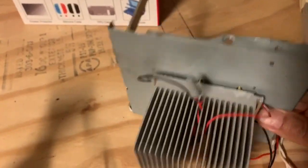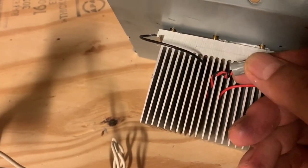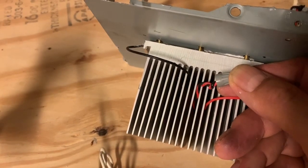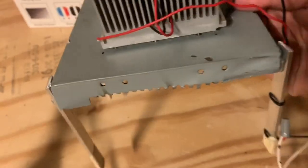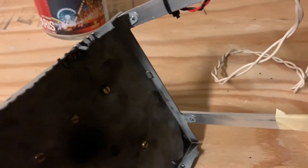The output of the thermoelectric modules I joined together, so I have series outputs. I took two of the wires — the plus and the negative — and joined them together. Then the other two double up the voltage, so I've got about three volts. The legs are made out of aluminum strip, and I just drilled holes in the metal and used metal screws to attach them.